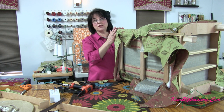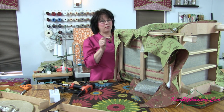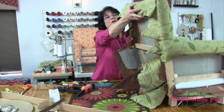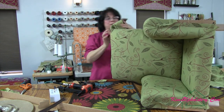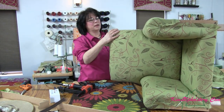Off to the other side, then we'll come back and fill the first corner in. That way, if I need to change this corner because the other corner came out better, I don't have a ton of work to do — I can just pop one staple and readjust. Oftentimes your second corner comes out better and you end up wanting to change the first one to look like the second.